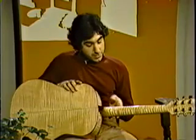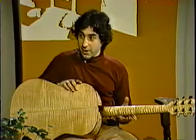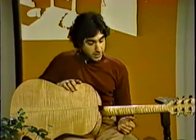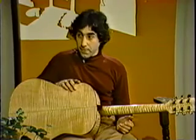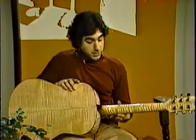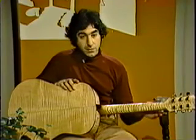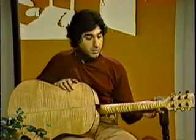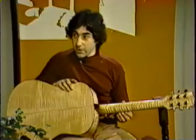and finally, after I prepare the wood itself, I take it into a lacquer booth where I spray about 5 coats of sanding sealer, and then I level that all down flat with 400 grit silicon carbide sandpaper. And just like a car, like an automotive finish. And after I've done that, I then spray about 10 coats of clear lacquer on top of that.